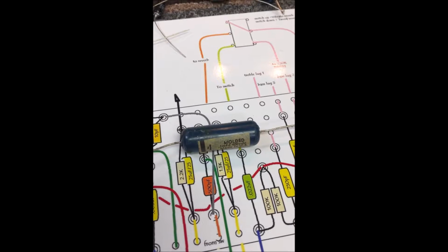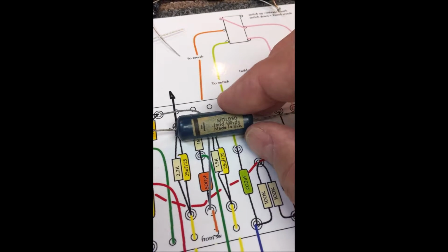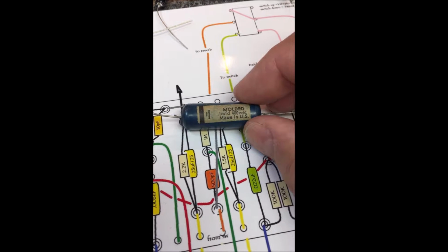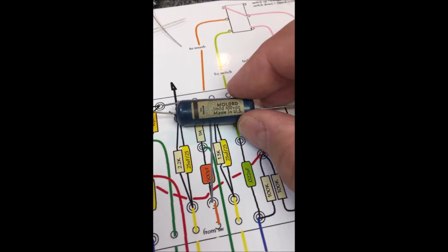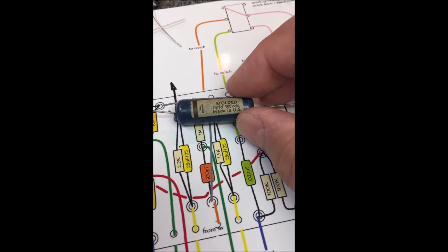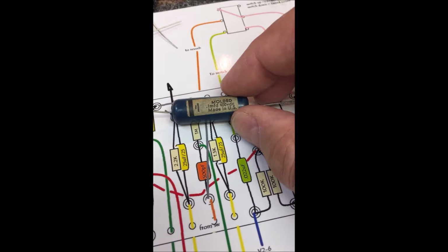People that are real cork sniffers about caps just go nuts over them because that's what the original Fenders had. And a lot of unscrupulous techs take them all out so they can use them for other amps, and they put in new orange drops and tell the customer that they made their amp a whole lot better. Coupling caps rarely ever leak. Usually they're either good or bad. If they're leaking any DC voltage, then they're bad and you get rid of them. Other than that, they're good and you keep them.